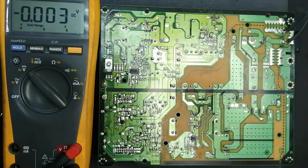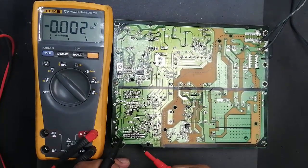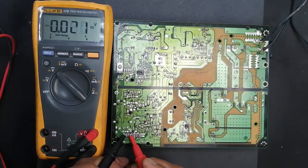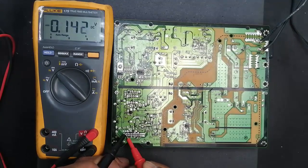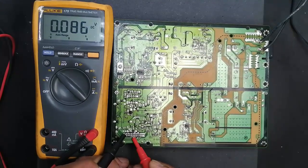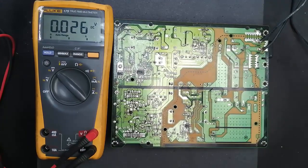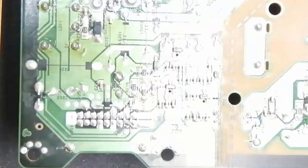Now I will make our own interlock — I will make a jumper. We will check the other outputs; the other outputs should not be available until we make the jumper. Just only 3.5 to 3.3 volt should be available at this connector. Only one output should be available all the time, that is 3.5 volt. All other outputs must be missing when there is no power-on interlock.